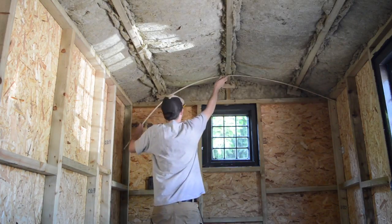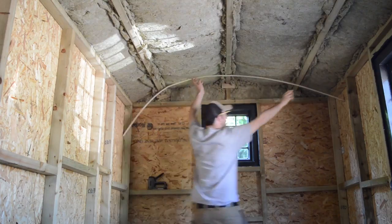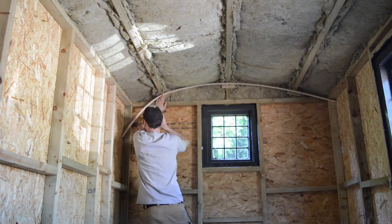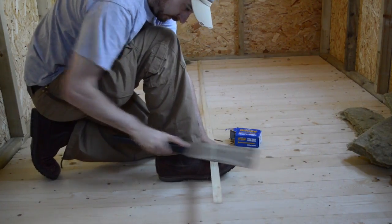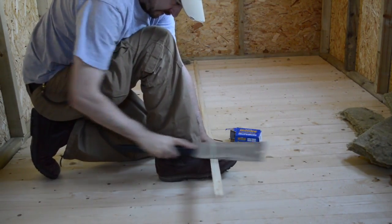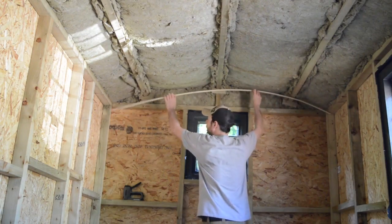The ceiling is going to get lined with some thin sheet of plywood that would bend to the curve of the roof. It's hard to measure a curve with a tape measure, so I got a thin bit of wood that was flexible that I could bend to the curve and then cut it down to the correct length. I just kept offering it up and cutting little bits more off until it was a perfect fit.